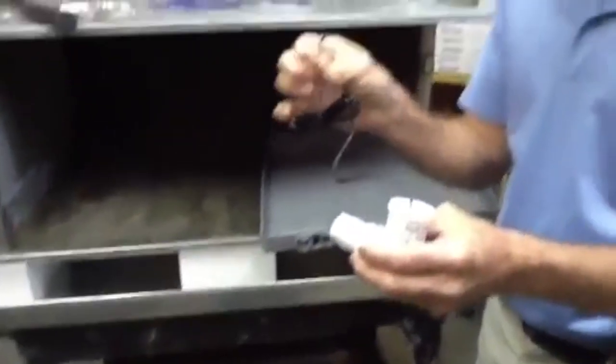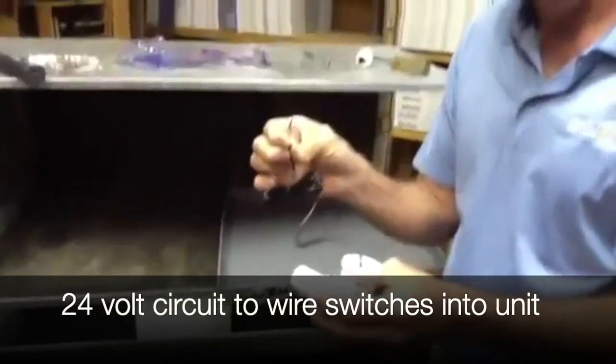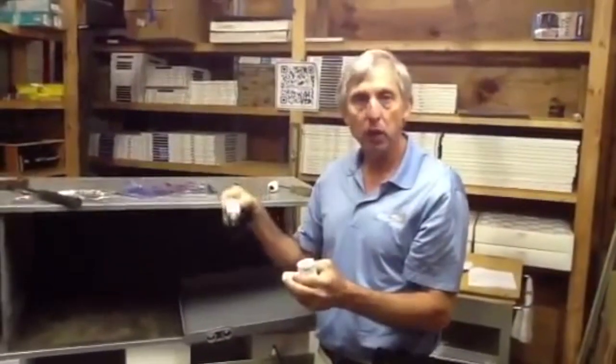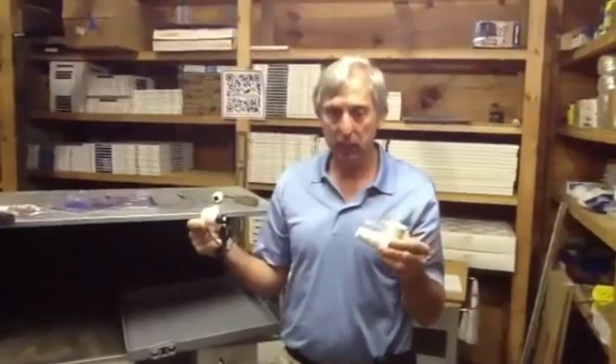These wire in by simply breaking the low voltage 24-volt circuit. As the water kicks out the switch, it shuts the system down — that's why they're called safety switches. These are worth a fortune; they can save tens of thousands of dollars in damage. We are firm believers in these. Please share, comment, and subscribe to our videos.